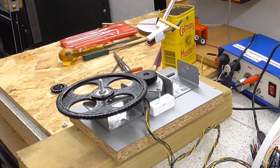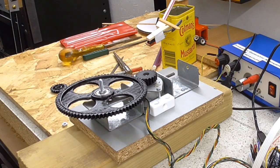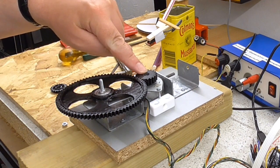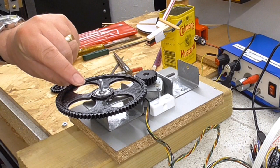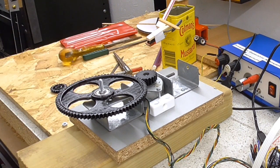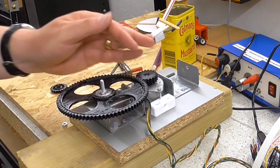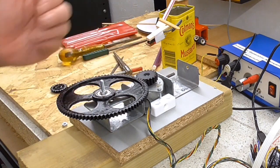So that's at 78 rpm. When I say 78 rpm, this gear here is going around at 78 rpm — this is four times slower, so I'm going to need to speed the motor up. I'm also going to need to change the direction because this bit here is now turning the opposite way to the way the stepper motor is turning. But clearly there is a bit of a noise problem. I'm going to have a bash at mounting it in a better way and maybe filing some of the teeth down a bit more and just generally tweaking and adjusting it.